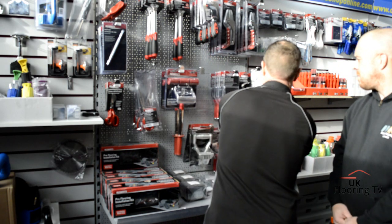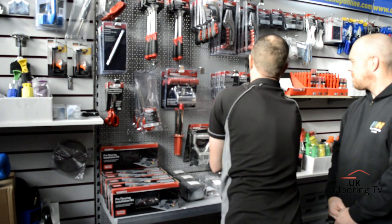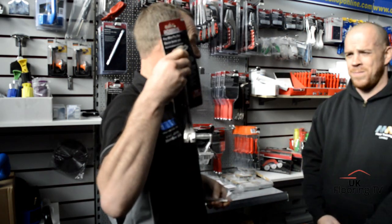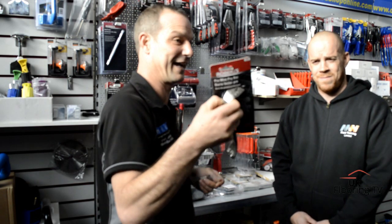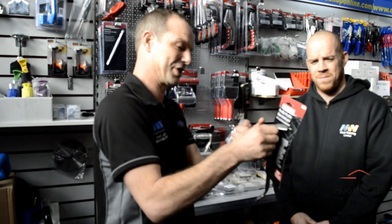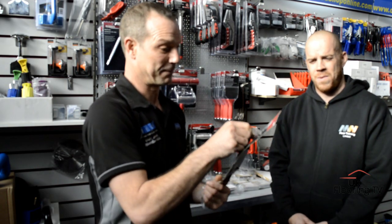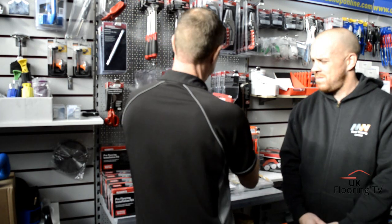The tack lifter is something I use as well - probably one of the most useful tools in your box. It's the uplift tool of the century for a carpet fitter. The angles on it flick things up really well. It's surprising how many people haven't seen these - brilliant. They're about six quid and they get the stair grippers off nicely.